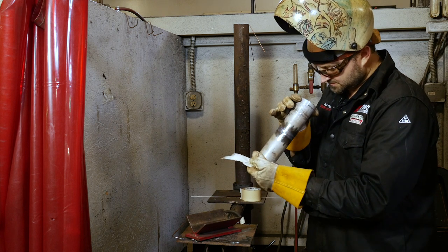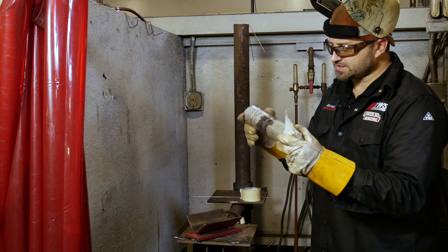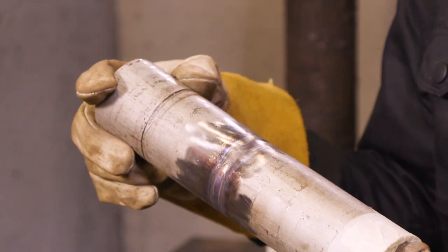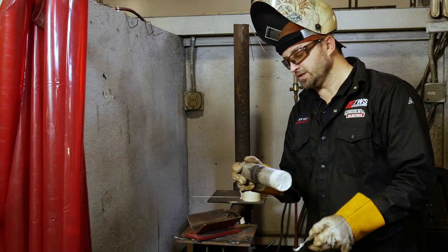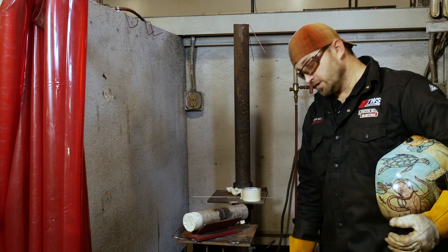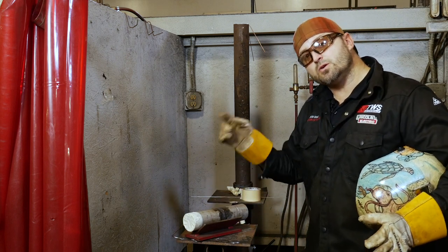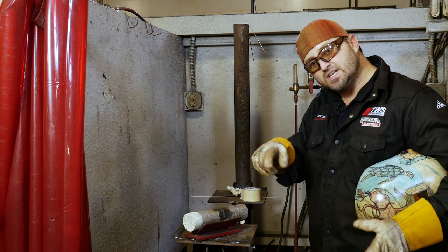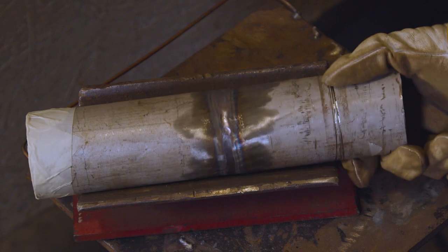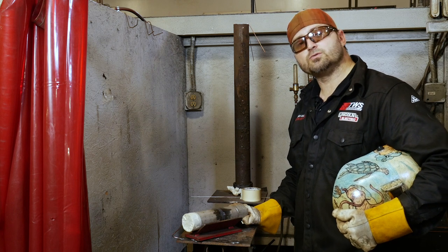It's hot — oh yeah, we're good. All broke down, walls looking good. Money in the bank. This is how you make a two-inch Schedule 10 stainless steel. Let's walk back through it one last time: the metal's been clean, we've got a nice sharp tungsten, we're running off a remote at about 70 amps, keeping a nice tight arc length, just fusing it in there. Watch the puddle — once it breaks down the walls, it starts to get a little turbulence because the argon's blowing up against it, and that lets you know you're breaking down the walls. Just keep it moving the whole time. You can rotate it, spin it around — that's how you make a two-inch Schedule 10 stainless. I hope you enjoyed it and look forward to working with you someday. Thank you very much.